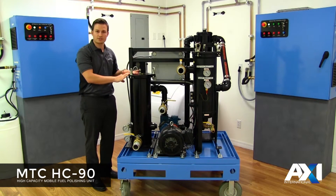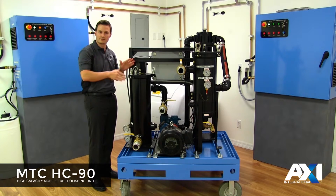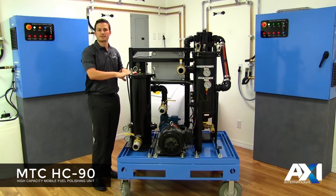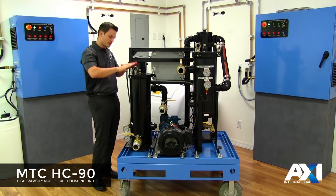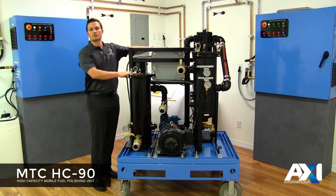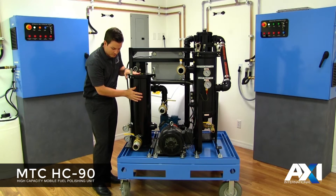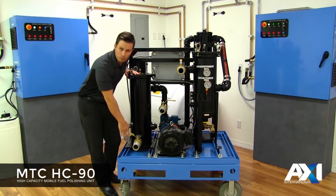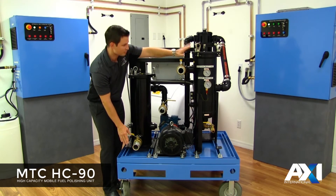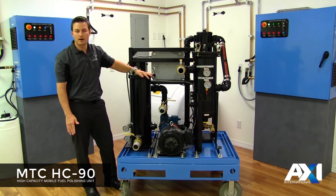The fine filter vessel is on the pressure side of the actual pump, so we provide a pressure switch on the upstream side of this filter, allowing you to know when this filter is clogged. We set those at around 22 psi, and that lets you know it's time to shut down and clean or replace this filter. You'll see that alarm come up on your electric controller, and at that point you can open this up and service the actual filter. Finally, you see discharge port two — this is when you're actually running your fine filtration mode. You're going to go through your inlet, still pre-filtering and removing free water if there's any left, through the magnetic conditioner and then through your fine filtration vessel.